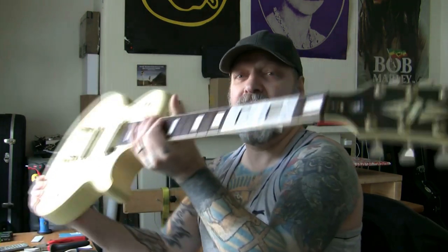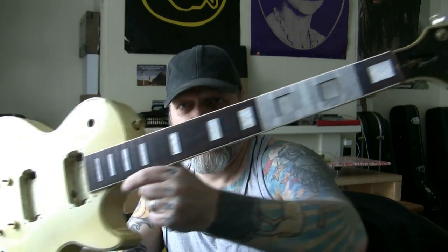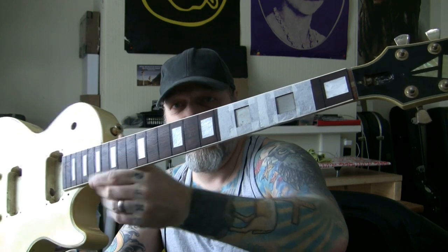We're going to do quite a lot of things today. First I'll show how we've taped up the old areas. I'm going to mix up some epoxy, drop them back in, and tape over them with Teflon so the glue doesn't stick. We'll give that an hour or so. Then I'll sand everything, re-radius the fingerboard, sort out the electrics, and I'm ready to cut the frets now.